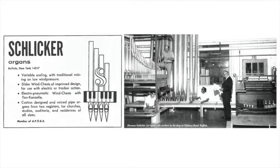Pipe making is a whole art. On this tour, I didn't get to see pipes actually being made, although I have in the past, and the best I can remember, there would be rectangles of a certain blend of metals laid out on a table, all cut to the proper sizes for the different notes of a rank of pipes. The rectangle of metal is curved around so that the two long edges meet, and then it is welded together in one stroke from the top to the bottom. This stroke takes a lot of practice to learn, because if you touch the pipe too hard, you put a hole in it. If you don't touch it hard enough, you don't seal it.